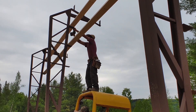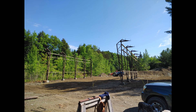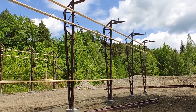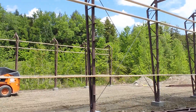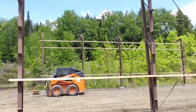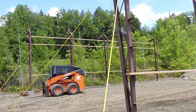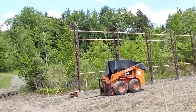Here we are installing the girts — we did a quick row of them just to hold everything in relative spacing. You want to do a good job of measuring that, and once your girts were up, you can use these cross ties or braces to level one whole side in one axis. Those were held on with a little angle iron with a hole in it and a clip on the leg or post. The angle iron sits up against the leg, the threaded rod goes through, and then you tension it down.